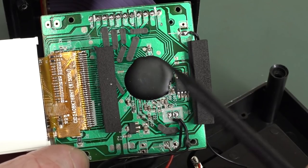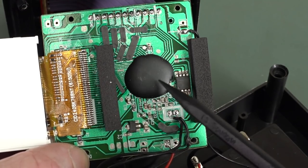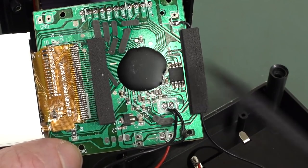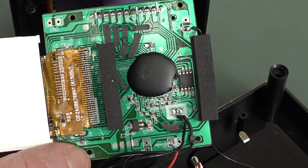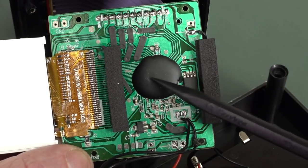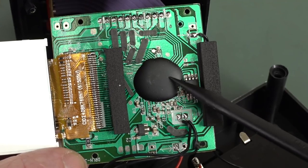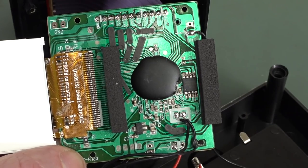It is a black blob - so that's chip on board. They just glue that straight on there, then run bond wires over to the pads, then gunk the whole lot. We've got an SO8 package happening there - I'll have to look at the part number - but that's a regulator. Not much else is there, but that's all you need. They've developed a custom ASIC for that, or it could be a pre-programmed microcontroller - a big flash memory ARM processor or something like that. Maybe one of those obscure Chinese brands. They just get it in die form and blob the whole lot, so not necessarily an ASIC under there - you can't make that call unless you actually know what's going on.